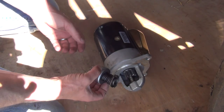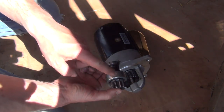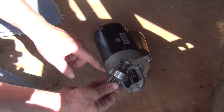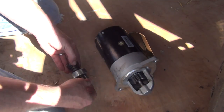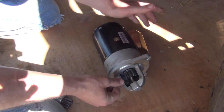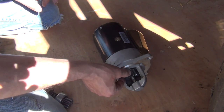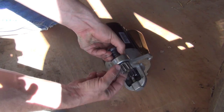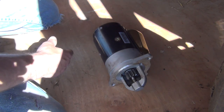We are back. The guys up there were real nice - first time I've been to that tractor place. This little plunger here actually has a clutch in it, and when it starts to spin it's supposed to grab. He basically replaced this whole piece - put a new one on. He tested it and the solenoid did test fine, so that's working properly. What was happening is this was spinning out and engaging, but the clutch was burnt up inside - it was slipping. So this will engage with the flywheel and then it was just spinning freely.